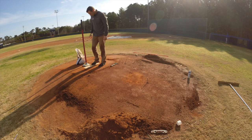So essentially, once you get those elevations right at your 5 marks on the downslope, it's just a matter of tying everything into that 5-foot wide landing strip. So, finding the high spots, scratching them down, adding some low spots. Typically on the sides, you can start rolling off. Just figure out what you can do in terms of moving material around to get that entire landing area sloped out to a nice consistent fall all the way towards the grass edge.